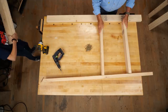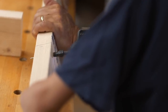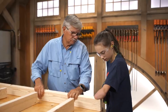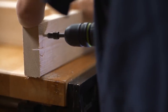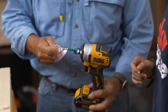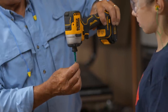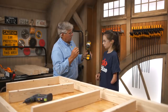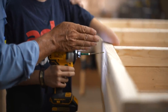Now we're ready to fasten our short pieces to the long pieces. What we want to do first is pre-drill some holes here for the screws — three quarters in, three quarters down. When you're eyeballing the drill, the imaginary line comes through here. You don't want to be angled off. If you can seat that tip into that screw tight and straight, you're going to have less problems driving them. See how your shoulders lined up like that? That'll give you more driving power.